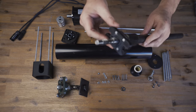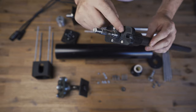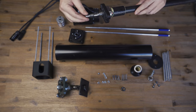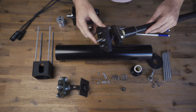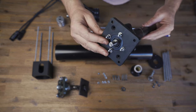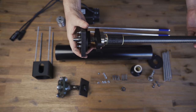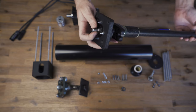First thing you want to do is mount your slider to your ball screw — pretty straightforward, four bolts, countersunk, so they're hidden away when it goes to calibrate. Ideally you want to mount the screw to your bearing so you can put the nut on, tighten it up, and hold the other end of the rod with some vice grips. Because this is an older design I have to reuse it, which makes getting the tightness on the nut a little tricky. I'll show you a trick I've used to achieve that.